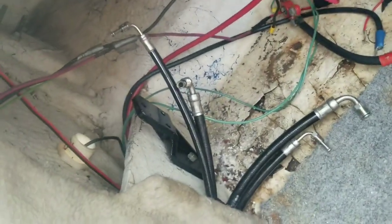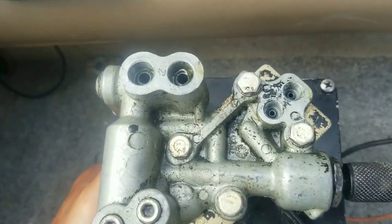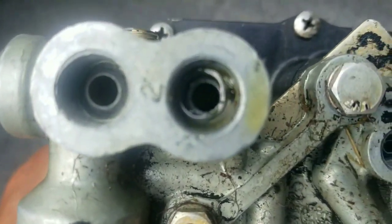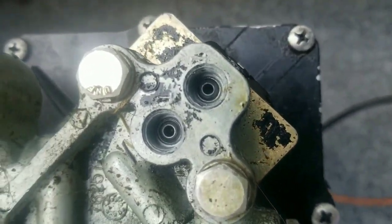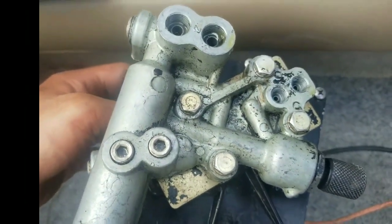Now that the bracket is mounted, we're going to get these lovely hoses installed to the corresponding holes down here. Again, it's almost idiot proof. We're going to take compressed air and some rags and really get all that gunk out — high residual oil, dust, anything like that. When inserting these tips, you want to make sure they are clean and there's nothing stuck on them — for obvious reasons. All four hydraulic hoses are installed. This is the 10 metric and this is the 13 metric. You just want to get them in there snug — you don't want to bend the valves or the pipes — but definitely make sure they're tight so there's no oil leaking.